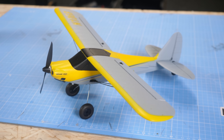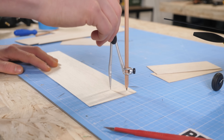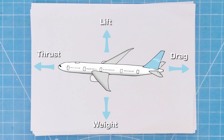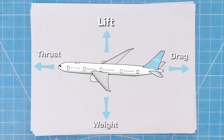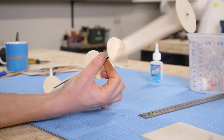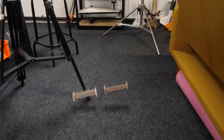The starting point for this project is going to be using a tiny little RC plane to test out the rotor system and to see whether we can actually make something fly with this new type of strange rotor. To get our small RC plane flying with the Magnus Effect, the Magnus Effect wing would need to create enough lift to overcome the plane's weight. So with a bit of balsa wood, I could start putting together some basic Magnus Effect wings, and straight away I could see that it was actually starting to create a bit of lift.